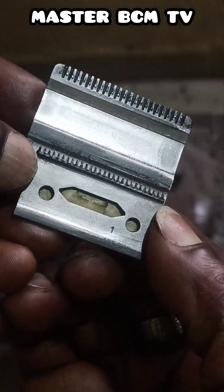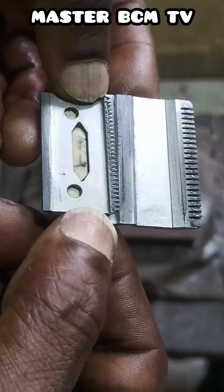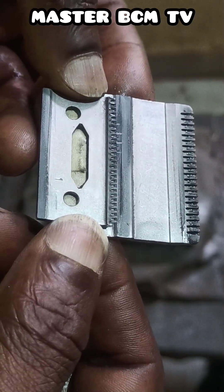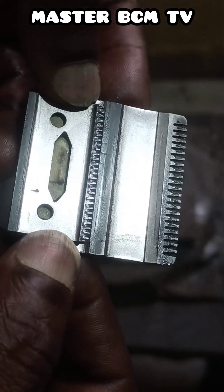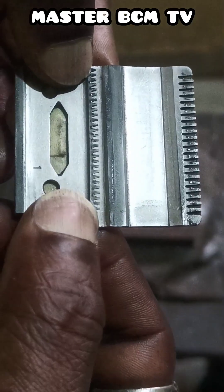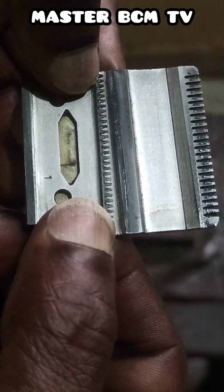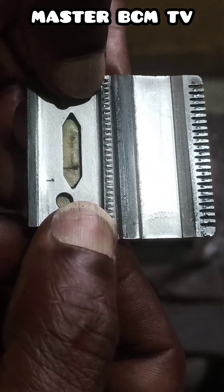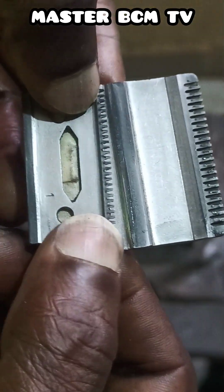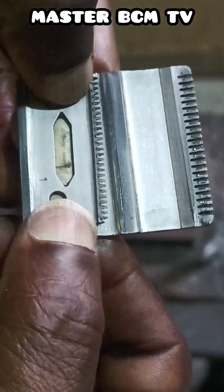You can see it now — the upper and bottom clipper blade have agreed totally. When you sharpen your clipper blade and test it and discover this result, it means you are a real professional and the blade is going to work fine. There is no space between the upper and bottom clipper blade inner surfaces when placed together. Please like, comment, share, and subscribe so you are first to see new videos. Be expecting another valuable tutorial — I'll be giving you different sharpening techniques for different types of clipper blades in the barber workshop. Thank you.